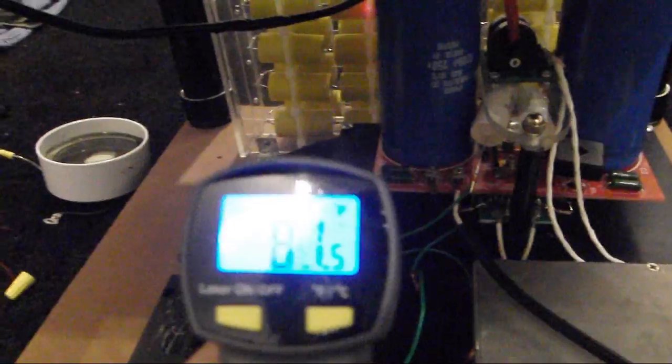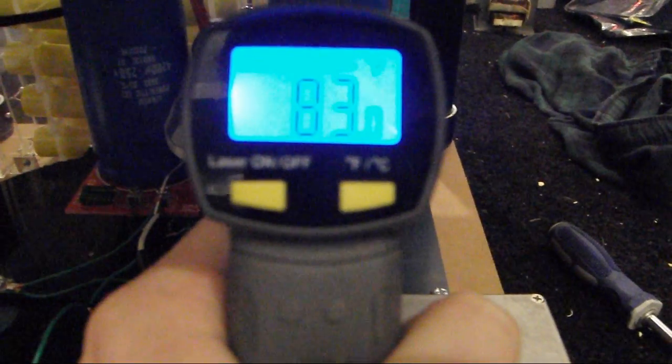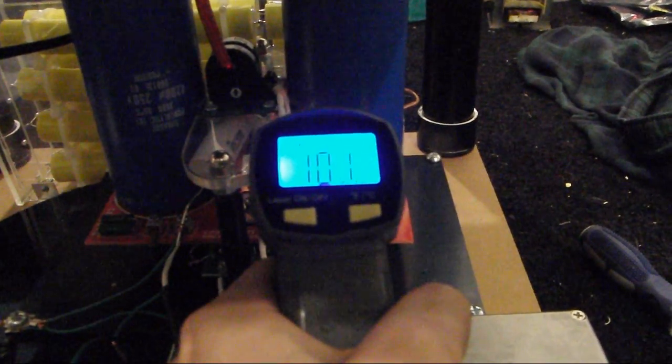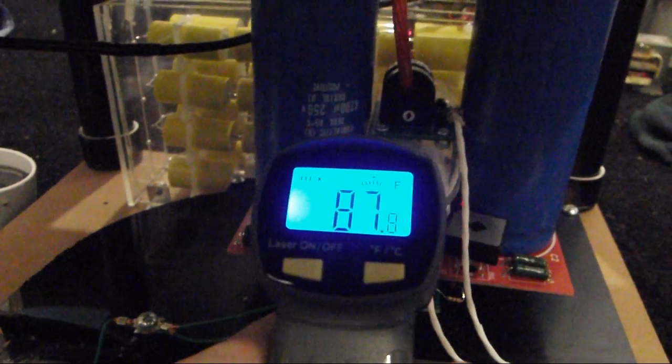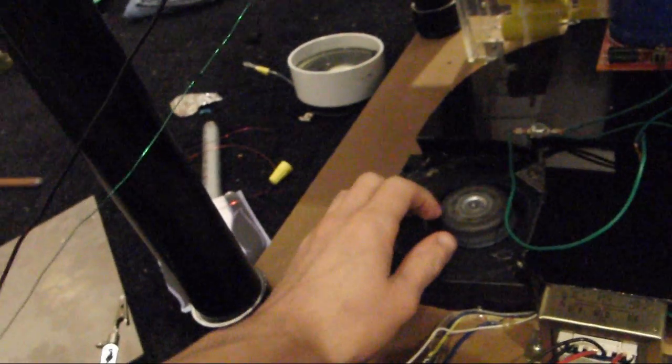As for the internals, the heat sink reads at about 81 degrees, 80 degrees. And that's where the IGBT, which is a CM300, is connected to. The capacitors which are computer grade are 82 degrees. The rectifier, no surprise, is about 101 degrees, 100 degrees. Everything else on the board though is fine on temperature. Nothing's getting too warm. The box is obviously room temperature. I think room temperature is 78 degrees, and that was running this without its cooling fan because so far I'm not pushing anything near enough to overheat this 11-inch heat sink.